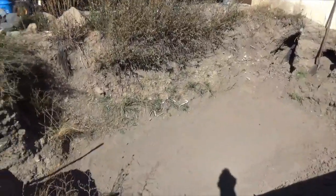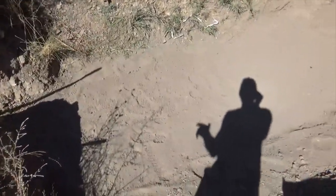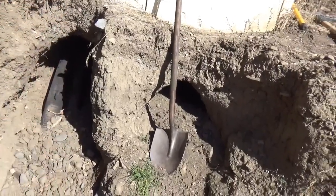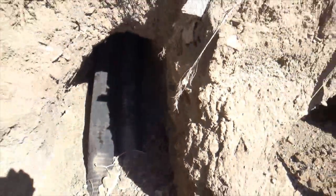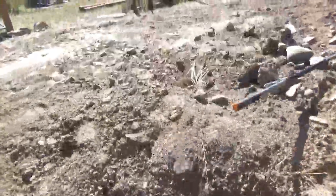The hole here is prepared for the cistern we're going to be using. We've got it graded, I brought in some real nice sand down here, and we took out all the big rocks. We've got the earth tubes that are in and out — this is the out, this is the in. We're going to be plumbing it next to the out tubes, because these are going to be drawing the hot air out of the greenhouse and they're going to prevent any freezing in our water line. Well, that's the plan, at least.